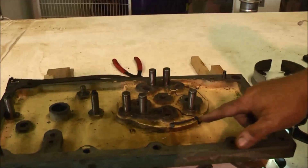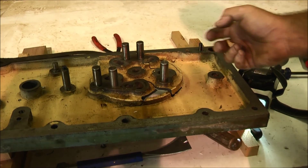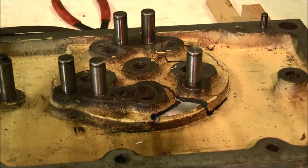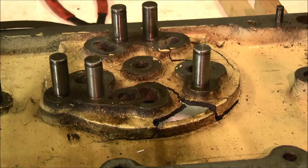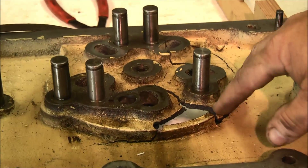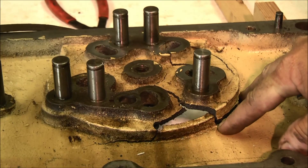This is the worst damage here — the feed box casting. All these dogs and everything: one of them was broken, the rest are okay, but the casting is pretty beat up. We've got to press all this back into shape, braze it together, and put everything back together.